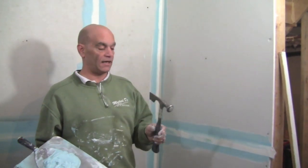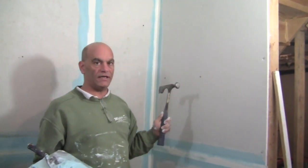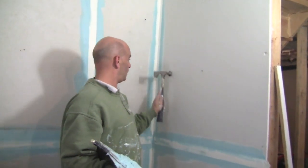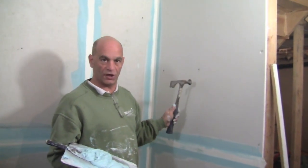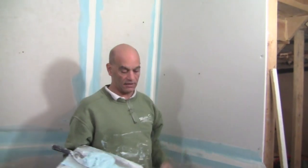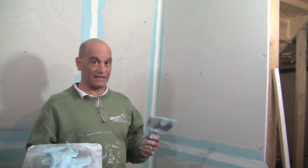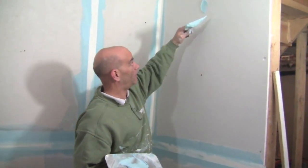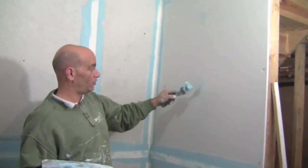I put these in with nails, so I'm going to use the same hammer. Go over them like that — real fast. If I feel or hear the nail or screw, I know I'll certainly see it when I go to tape it. Go over it like that. If you had to push it in a little bit, use a hammer — even if it's a screw, you can bang a screw in a little bit with that. Just give it a nice shot so it's not sticking out anymore. With the mud, you're going to be taping this two more times at least, so you'll put more coats on. But for your first one for nails or screws, just real simple — like that, then scrape back off. That's what you're doing on your very first one. The second one, we're going to fill it in even more.